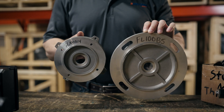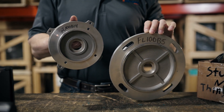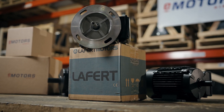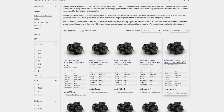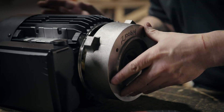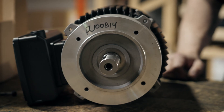My favorite feature of the Levert motors is how easy they are to customize. A lot of IEC metric motors are flange mounted. The two common flange types are B5 and B14. When purchasing a Levert motor, double check if you require a flange. On the eMotors website, we have added dash B34 or dash B35 to the end of the catalog number to indicate if the motor has a flange already installed. If you cannot find your required motor with a flange pre-installed, you can also purchase an off-the-shelf motor plus the flange and we'll install the flange for you.